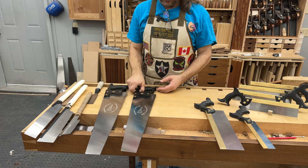I decided to make the handle out of Corian after visiting a saw maker in Oregon and seeing how long it was taking to make handles out of African blackwood. I thought, isn't there another material that would look like that, be impervious to moisture, not have a finish that wears off, and have the right weight? That went okay for a short while until I realized Corian taken down to small dimensions becomes very weak. Fortunately, someone in Indianapolis introduced me to Swanstone — essentially what Corian is, but with glass fiber added for strength. That's the saw that carried us through for the last 15 years.